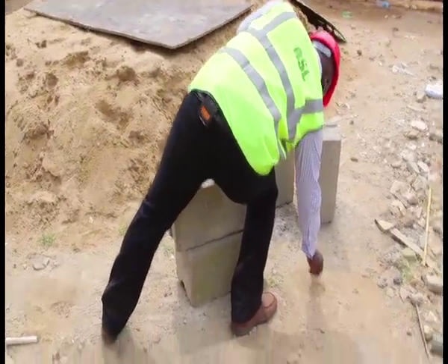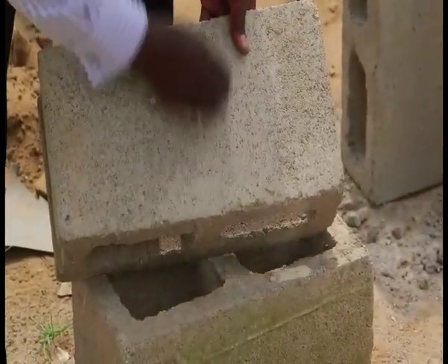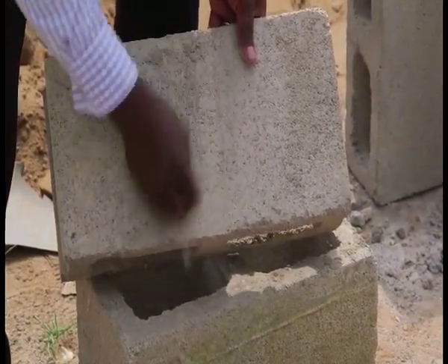Now, this is a small nail. Take it to the side and scratch the block surface. It's basically not leaving any major dent on it — which is a good sign indicating the block surface has sufficient hardness.